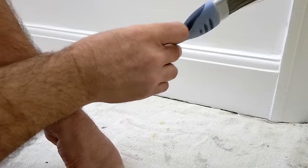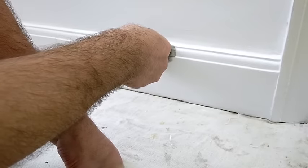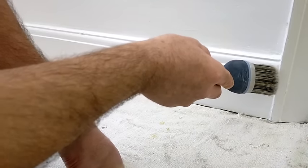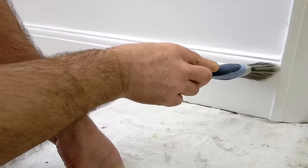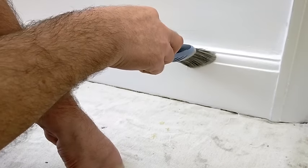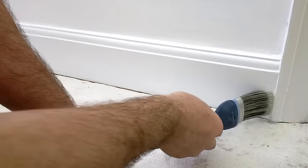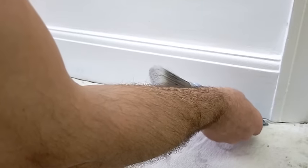Also when I applied, I worked from the architrave away — that will also form drips if you work that way. So always work away from those edges. Down here, the trim isn't flush to the skirting — there's a bit of architrave — again I worked away from that. You'll get paint running and a drip at the bottom if you're not careful.